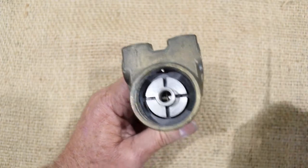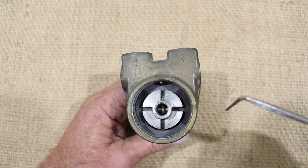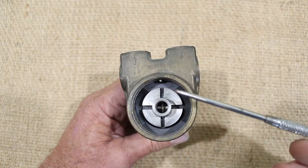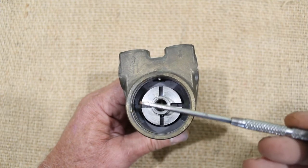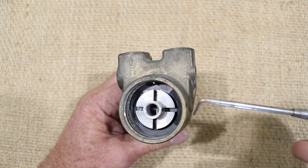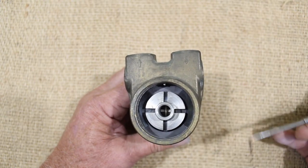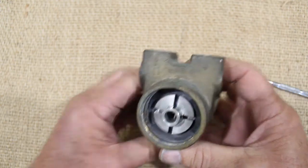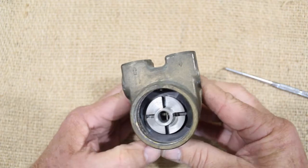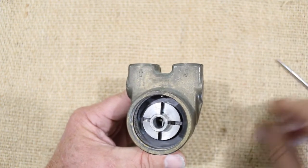Principle of operation means that these pumps would be classed as a positive displacement pump, meaning that any movement of the shaft transmits 100% transfer to movement of the media, and theoretically an infinite amount of torque applied to the shaft can create an infinite amount of pressure. Of course, we know that an infinite amount of pressure is not supplied by these pumps, otherwise they would disintegrate. A pressure limiting assembly is located inside here. And we'll have a look at how that works now.